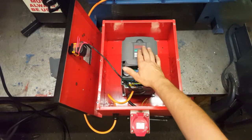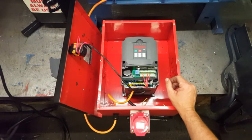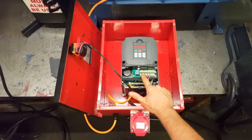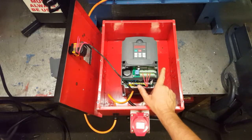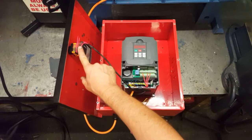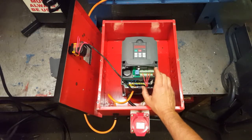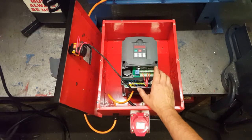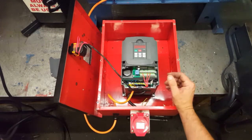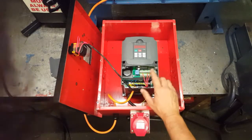I was worried about oil damage and sparks — I didn't want to keep opening and closing to get in. With the switch it's replaceable when you damage it. Quickly going through how to get that switch to work — it took a bit of time. I've used DCM which is your common, RST which is stop/reset, and FOR which is forward. That's all the contacts you need for a basic on/off assembly. It creates a latching circuit for you — a lovely little safety circuit — so if anything failed it would drop the circuit just like a latching safety circuit would.